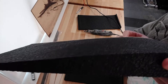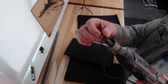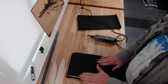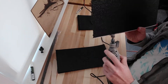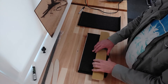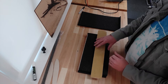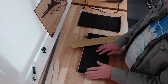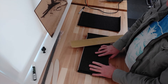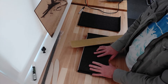The rib sits a little proud of the airfoil, so I'm going to cut that back closer with the sanding attachment on the Dremel, and when I get it close I'm going to put it back in the bed and hand sand it until it's perfectly flush with the airfoil surface. Definitely don't do this with an EPS wing or any compressible foam wing, as it will absolutely destroy the airfoil. Not as much of a concern with EPP since it doesn't sand that well. You can degrade the airfoil, but as long as you're not sanding too hard and you're being careful, you should be left with a very good airfoil. I've been doing this for years, but don't try this with EPS or anything like that.